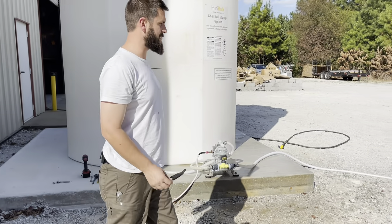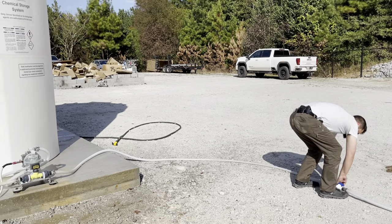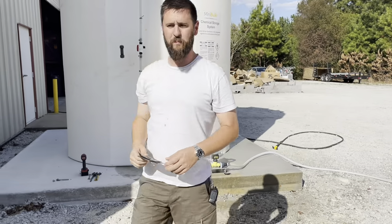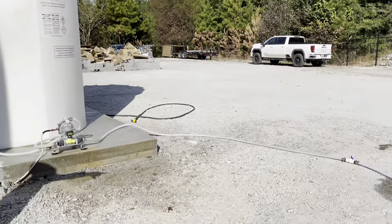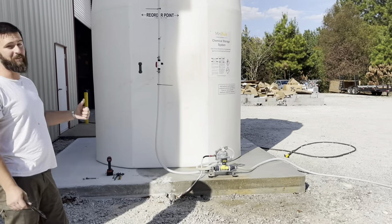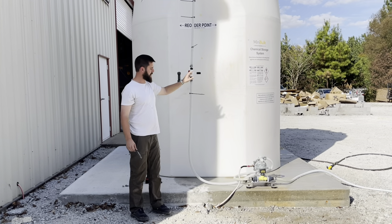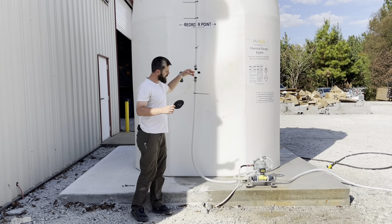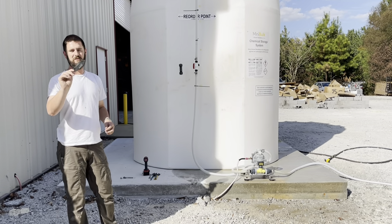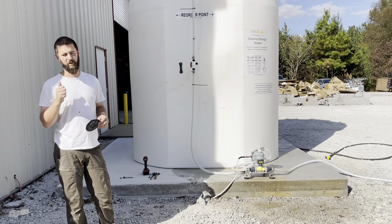On a big bleach tank like this, we put a couple of cutoff points — one at the end of the hose, because once it starts flowing it will gravity-flow its way down and empty the tank. You want to be able to isolate it there. We've also got one here for anytime we have to work on it — we can shut it off, bleed the lines down, and we're not going to have gallons of 12.5% just coming out. Got it fixed. Let's go get the right compressor and dial that PSI back down to about 85, and we'll be good to go.